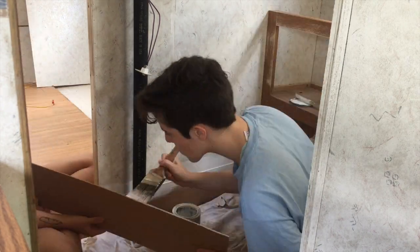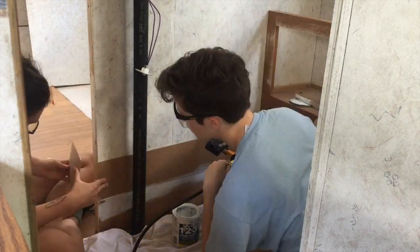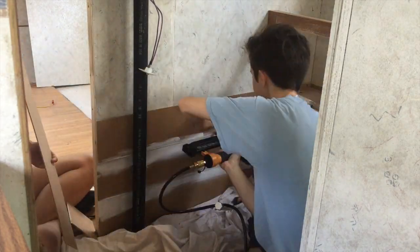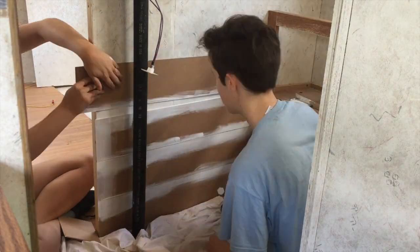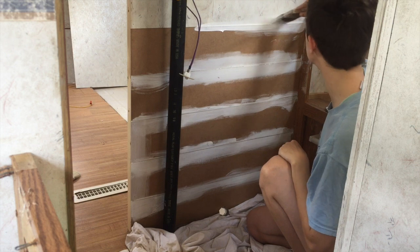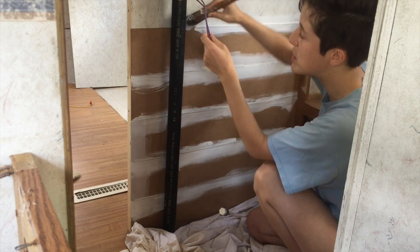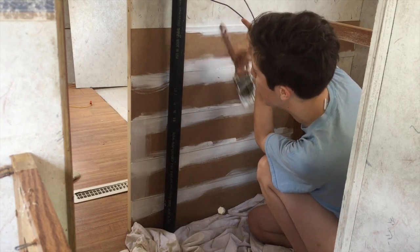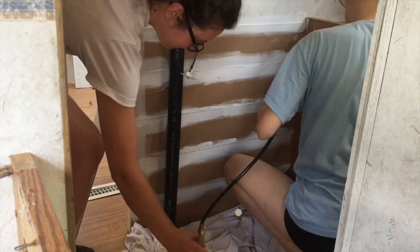For painting in between the cracks as we go up — the worry is that if you focus too much on it after and you just try to paint all this at the end, you might start clogging up the cracks with paint. So instead, as you go, paint the top and bottoms of your boards. This way, once you actually finish, you don't have to worry so much about getting paint in the cracks, as your crack will already be painted.